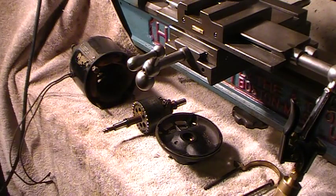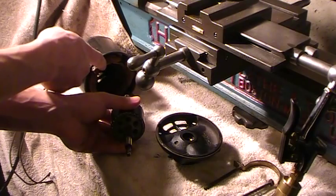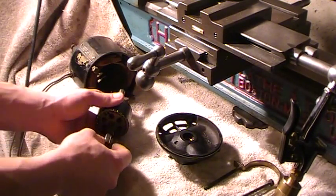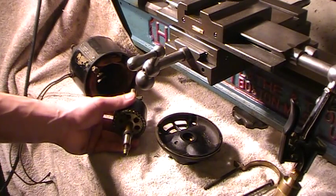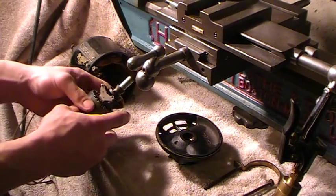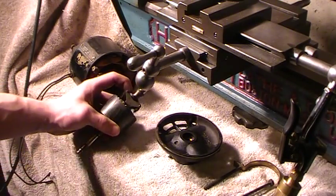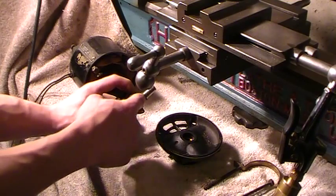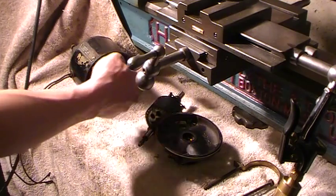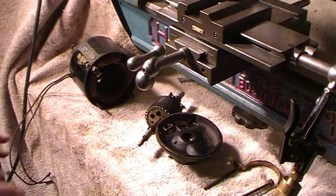They're always on. So when you plug it in, it'll be able to fire up because these start windings are engaged and energized. But if you had them energized the whole time, it would fry the motor in a matter of 30 seconds. So you've got this switch here — when the motor comes up to speed, these weights fly out, it pulls this collar in, and allows the contacts to open. It shuts your start windings off, so it's just running with the run windings on the inside. You have a nice, cool-running motor.